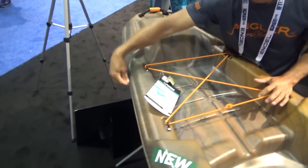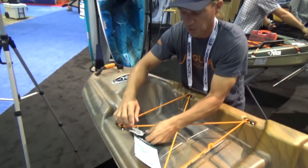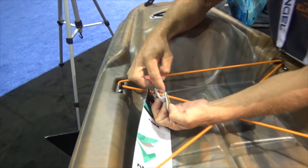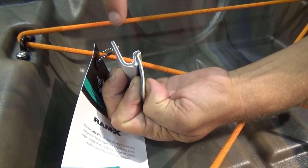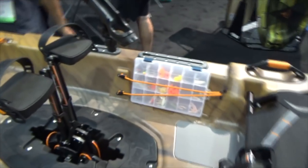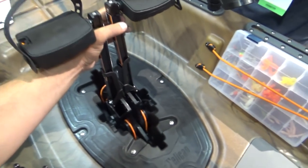It's also stiffer because of the seam. When you have this big seam running down the length of the boat, it prevents it from flexing. And it's really the strongest part of the boat. There's a cutaway version right here — it's where the two pieces come together, and it's actually thicker. They are welded together. If this boat were going to break, it would break somewhere else, because this is actually the stronger part. TST boats have outperformed roto-molded boats in strength and durability.